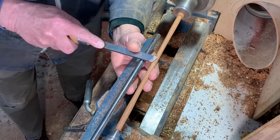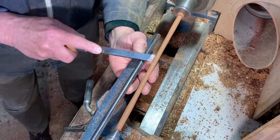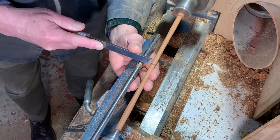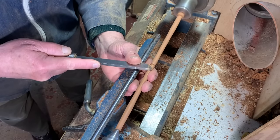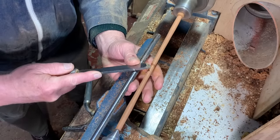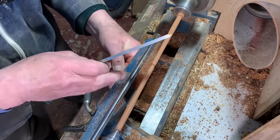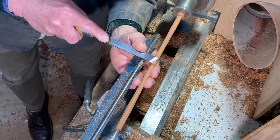There are various ways of doing that. One is to come in from underneath — the thumb is going to stop the tool kicking back. So if you're going to do a bead, roll the corner of the tool into the wood; these fingers support the cut. The dynamics of that are that the tool is pivoted against my thumb. These fingers are equalizing any pressure against the wood. The less pressure you have against the wood, the better — the cooler your fingers stay.